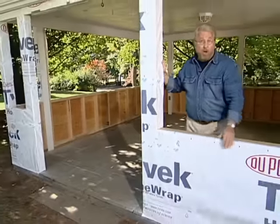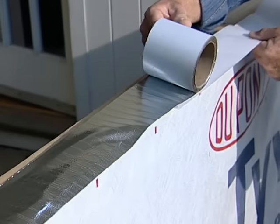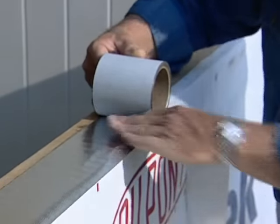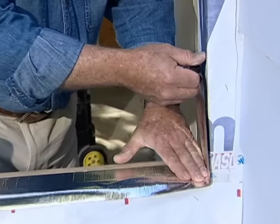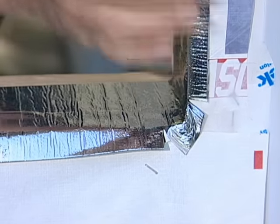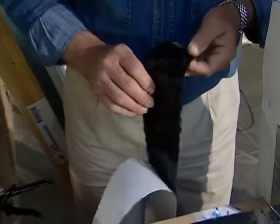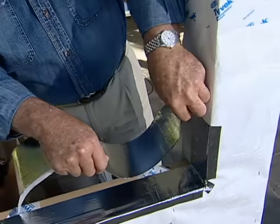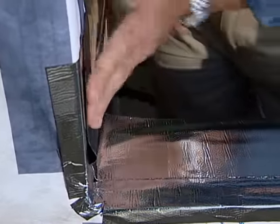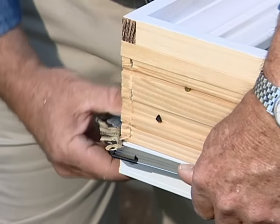With the walls in good shape, I'm going to do the same for the window and door openings. This aluminum tape will create a watertight and weathertight seal — I apply it to the sills and run it up the sides about eight inches. I cut it so that it can be wrapped around the corners and folded over the edges. Then I apply a second strip of tape to the rear of the sill in the same way.